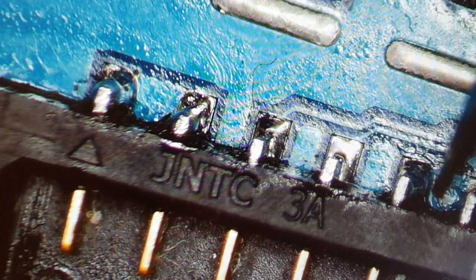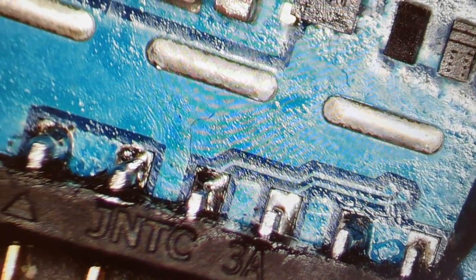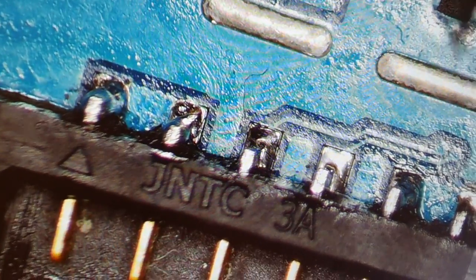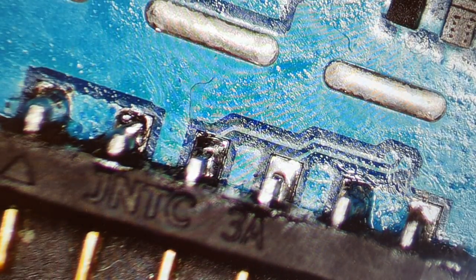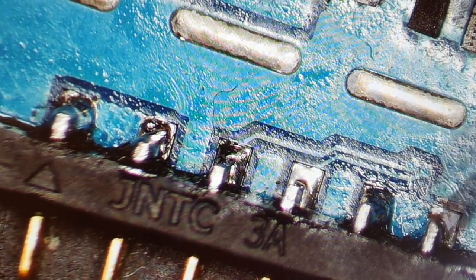It looks fine. They look fine. After I solder, I always check it again. If, oh, this one is not. This is what I meant. You have to check it carefully, everything, every pin, so that you will not have double work, so to say, later on. So this one moves.